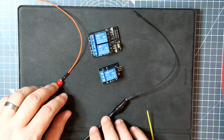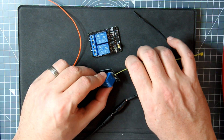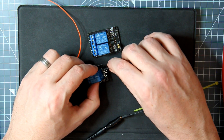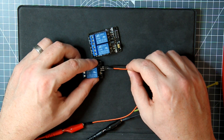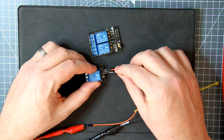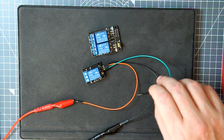I have a little bench power supply running at five volts, putting out 84 milliamps. Looking at the relay board, I have negative and positive, plus a switch I'm going to use to turn it on. I put the negative on the negative — that's as easy as that. You can use any five-volt DC power supply; it doesn't really matter. Then I put the positive on the positive. I'm then going to take my signal wire and put it on the signal pin.